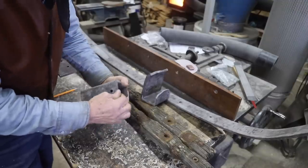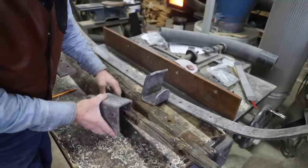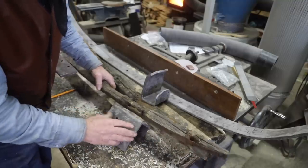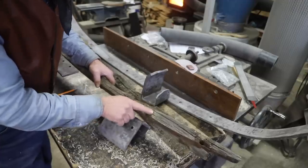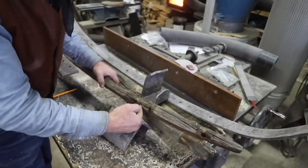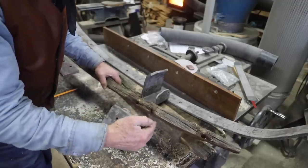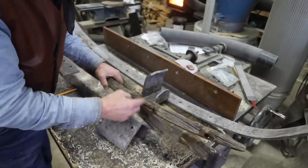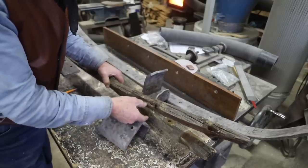Generally, a rub iron will be just a single plate with two bolts that hold it to the wood of the rocker, without this top portion. So I'm thinking that's probably what was original here. That rub iron would have been a flat piece of iron, designed to protect the leather of the thorough brace when the wheel turns and hits. It's a tire deflector to prevent not only the wheel from turning too far, the axle turning too far, overturning this coach, but it also takes the wear of the wheel off of the leather thorough brace.